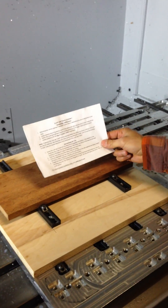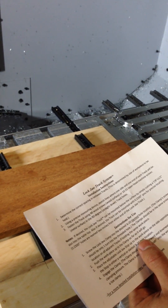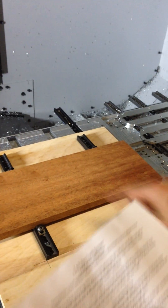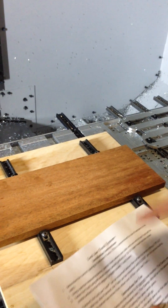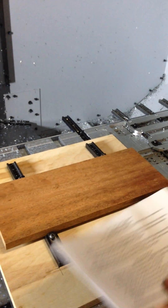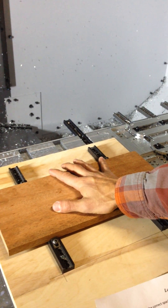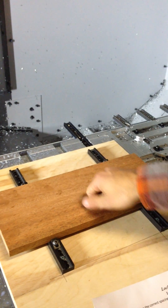As the instructions say, just go down bit by bit. I determined the correct spacing between the tracks, used a precise measuring device to sketch the lines, and fastened the tracks using number 8 wood screws. Then it's simply a matter of putting your part on there, putting the clamps on first, putting your part on, butting the stops up, engaging the stops, and engaging the clamps. Thank you very much — I hope you greatly enjoy your lockjaw track system. It is a great clamp, a wonderful clamp, and it will help you out greatly. Thank you very much.